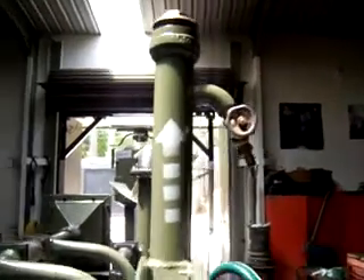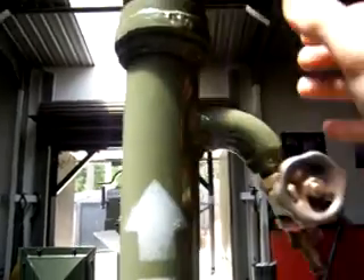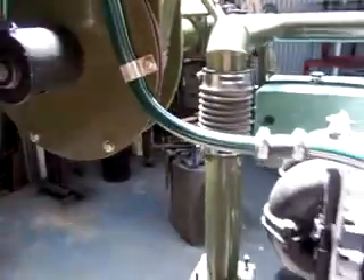I've done a little trick I've seen on YouTube — I've capped off the top of the air pump with a large brass nut which I can remove. I've got an attachment for a smaller hose so that when I want to fill up a vessel, an air mattress, or a balloon with gas for cooking, I just block that off, attach the hose, and the pressure gives me about a pound to a pound and a half to fill up a vessel. This is a 12-volt blower motor from a car, brand new, insulated with garden hose, and it leads down to the battery.